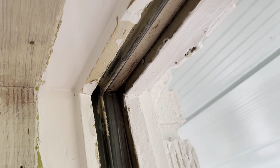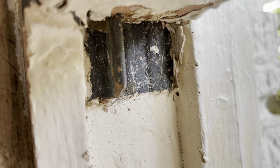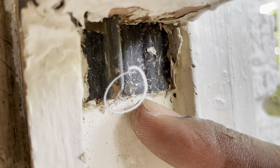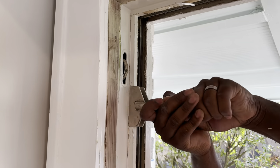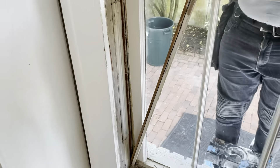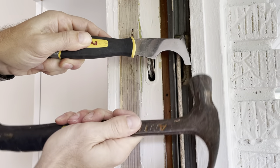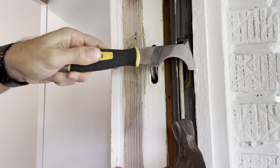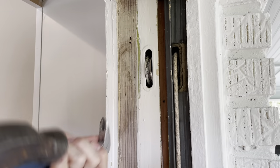The nails on the top sash weatherstrip are in a slightly different position. Right at the bottom of the top sash, you'll see one little nail there — we'll need to pry that out. First thing to do after lowering the top sash is pull the parting bead out. For these, I use duckbill pliers, which tends to work very well. You can get that out of position, then come in and get the nail out that's near the pulley — usually at the top, but sometimes at the bottom. You can use a five-in-one to get it loose, and I'll show you another approach on the next side.